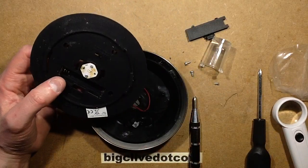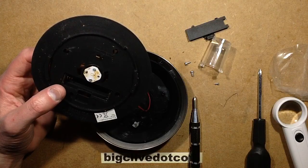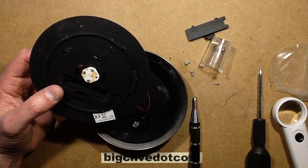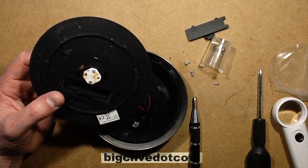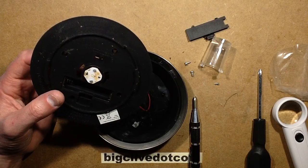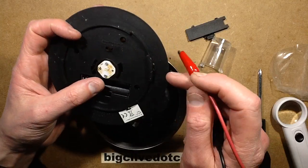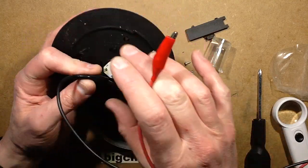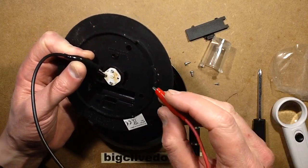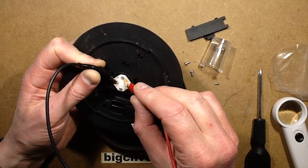Let's get my bench power supply and stick it on. I'll put the voltage up to just the point that the LED should be conducting — say about 2.7 to 2.8 volts — which will light that white LED brightly, but not pass too much current through it. And it's lighting, so that's a good sign.